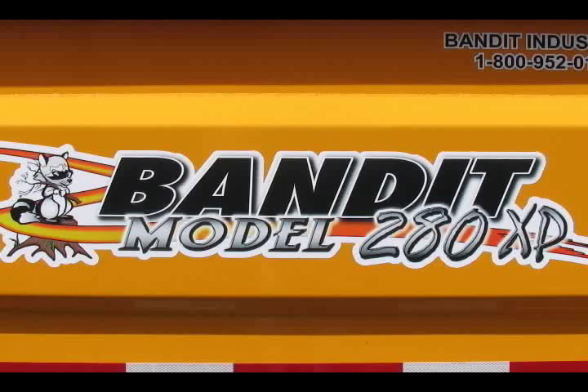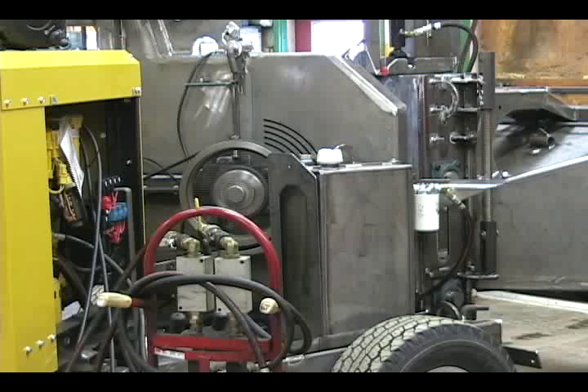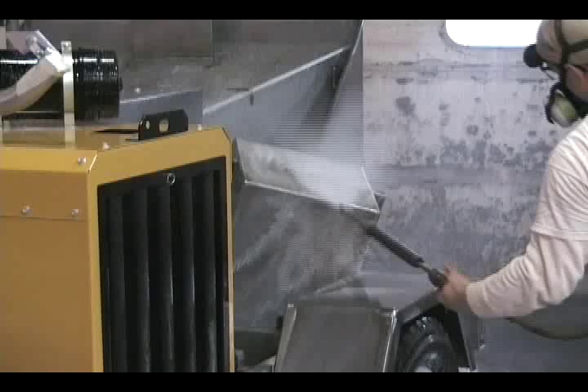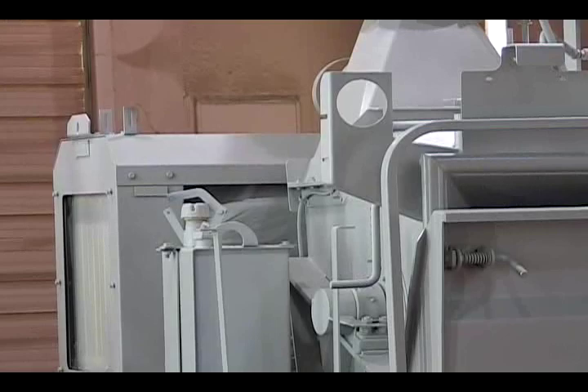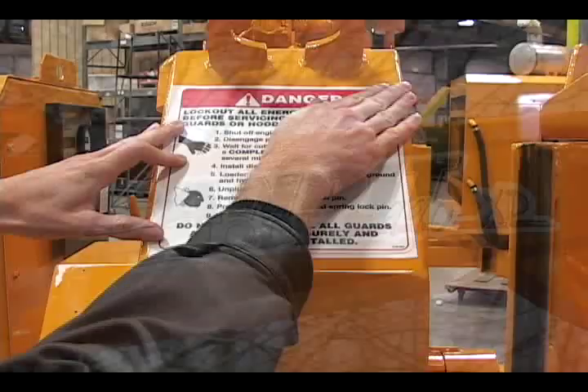Bandit chippers are provided with a high-quality Imron urethane paint finish, the best paint finish available for a chipper. When our chippers come off the line, all welding slag is removed. The chippers are then tested, making sure that all functions are performing to our standards. They are then put through a phosphoric bath to remove debris, grease and oil, dried and primed with an Imron primer, and then painted with an electrostatic paint system using Imron polyurethane paint. The finish is cured in a drying room before going to final inspection where the decals are applied. The chipper receives a finish that will hold up extremely well and resist wear.